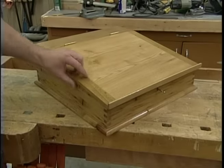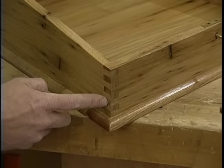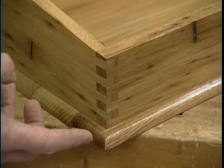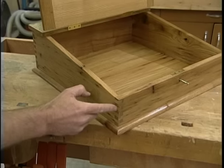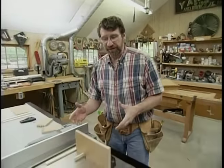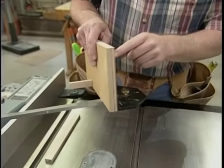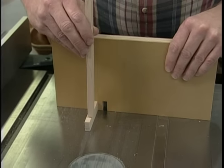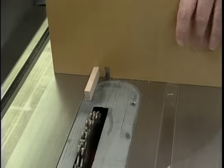One of the appealing things about our desktop writing case is the joinery at the corners — these are called box joints. You might have seen them on old cigar boxes or cream cheese boxes, even on boxes that held hardware. It's a beautiful joint and it's very strong because of all the surface areas where you can put glue. It's very easy to make box joints with a jig at your table saw: you take the miter gauge, attach a piece of plywood to it which has a pin and a slot, and then you have a loose gauge that matches the thickness of the slot, and this pin and your dado head are set at three-eighths of an inch. Let's make another jig.